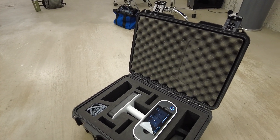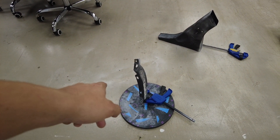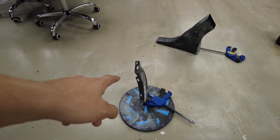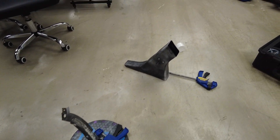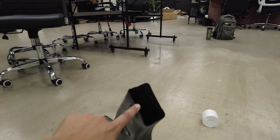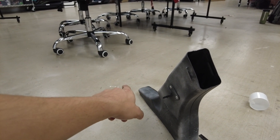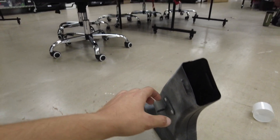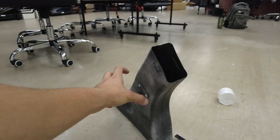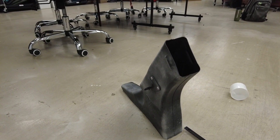We're now inside, quickly scanning a few pieces for the Type R. This is the headlight bracket — the challenge is that it can easily get damaged and Honda does not sell a replacement part for it; it's integrated into the OEM bumper, so we're going to recreate it. This here is the OEM brake duct — this is where it feeds into the fender liner, and on this side is where it sits on the bumper. We're changing it from a rectangular hole to a circular one, so we're going to reverse engineer this rectangular pocket to feed into the three-inch traditional tube. Shouldn't be too bad — those are the main changes.